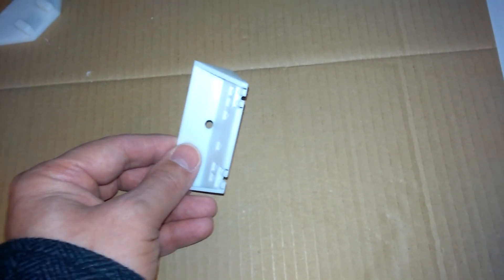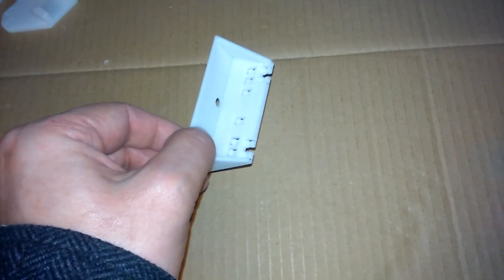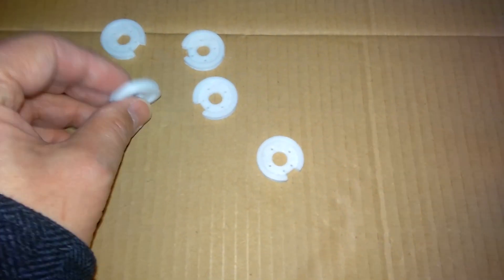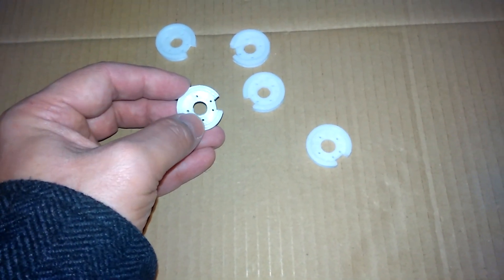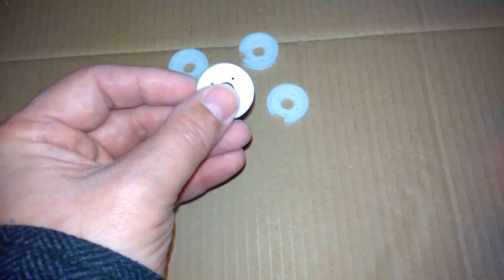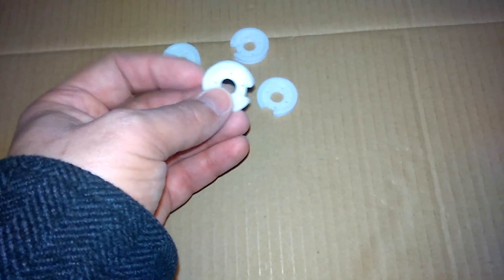Left tensioner - I've included it here for completeness but I probably won't be using this at the moment. I'll probably come back to the forearm sometime in the future and fit the springs that attach onto these tensioners. I don't have any springs at the moment. Finally we've got the servo pulley - times 5. One single print gives you 5 servo pulleys. I've actually printed 10 because these are one of the only parts that are the same on both arms - they're not handed left or right. I just filed around the outside to completely remove the brim and gave everything a quick sand.